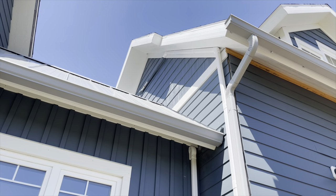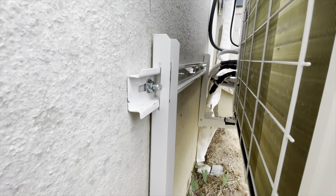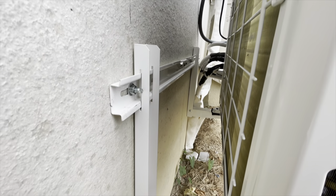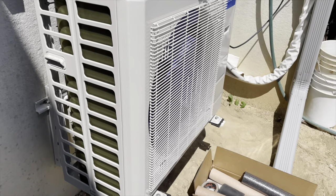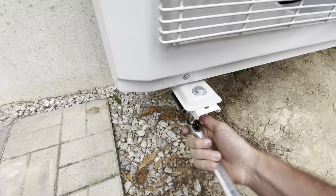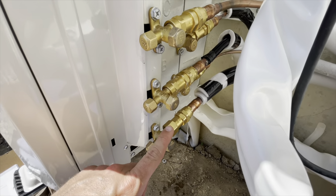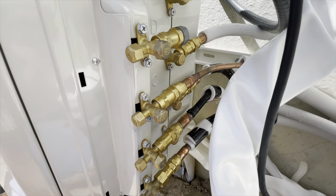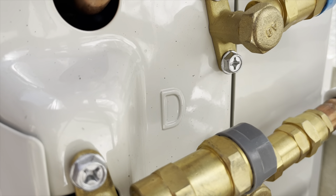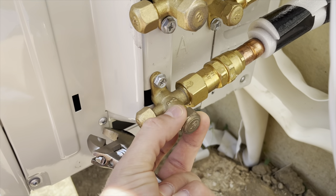Something I unfortunately didn't get any footage of was the hanging of this bracket as well as the mounting of the unit itself. Hanging of the bracket just consists of — I believe we had three 3/8-inch concrete anchors into the wall to hold this bar. Then these two arms just slide onto that bar and hang, and we also fastened those with a couple 5/16-inch concrete anchors. Then you just have to lift the unit up onto these arms — even this 36,000 BTU unit wasn't too heavy for me and my dad. Then you just have to fasten the feet to the arms with bolts at all four corners. They also come with little rubber feet that you can put in between there to help minimize some vibration.